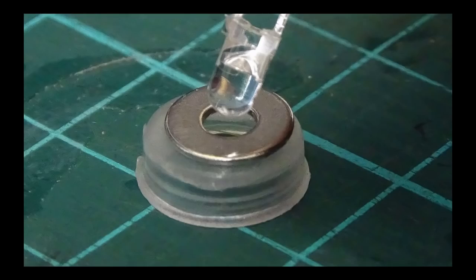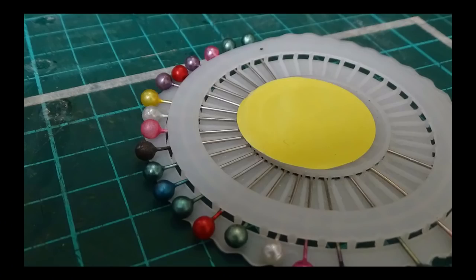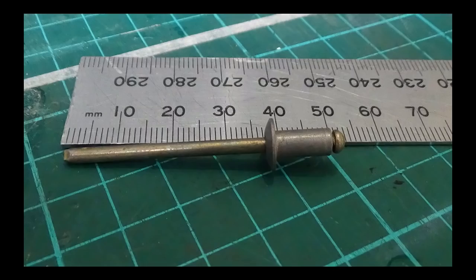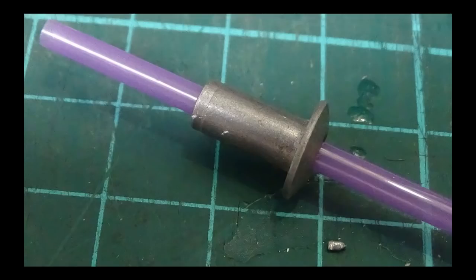You can see the LED will fit nicely in there. We're also using cocktail straws — approximately 130 millimetres long and three millimetres in diameter. For the ball on top of the post I'm using ball head pins, readily available from two dollar shops or pound shops. You can either hold the pin with pliers and screw the ball off, or cut the pin close to the ball — I prefer to cut. We're also using a rivet approximately 50 millimetres long with a three millimetre shaft. Once removed it leaves a nice base for the straw to go into.